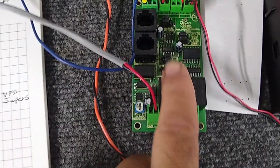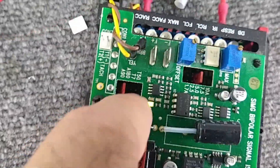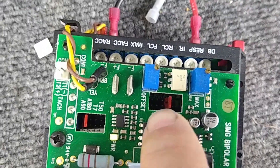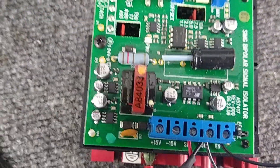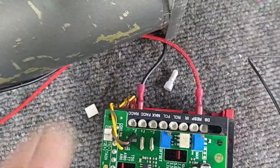It's reported this board has signal isolation, so technically you don't need the external isolator. For the KBMG-212D jumpers, set to A90 and set the current for your motor — I left it at 7.5 amps, though it's probably less than that. Follow the manual for the KB Electronics KBMG-212D and the SIMG signal isolator. You'll need to do some tuning with the pots for your motor.